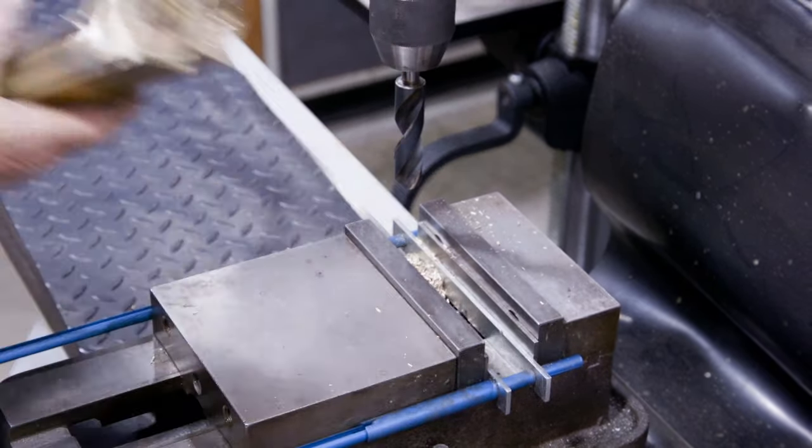There they all are. We're just going to bolt these things in and it's coming together pretty good so far. I'm kind of liking what we've got going on with that bearing housing. One thing I noticed is these bolts stick a little proud of the very bottom — which is actually going to be the top where the glass goes. So I need to take these over to the lathe and knock about an eighth of an inch off them. They were just maybe a sixteenth of an inch sticking up, but it was enough to make it uneven.